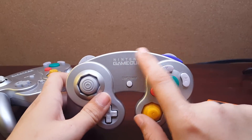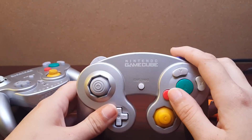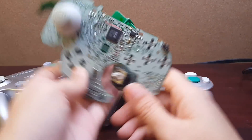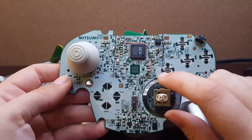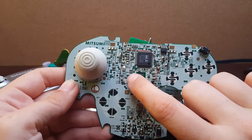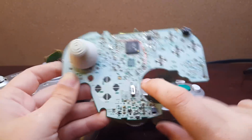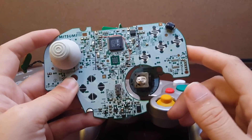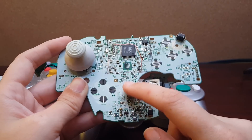The WaveBird circuit board just fits in there — you do have to trim it and relocate a few things, and I had to modify the shell in a couple of places, one down here for the batteries and a couple up in here, but it's almost an exact fit. I cut from about here up and past through the middle of the start button, over and down, then made a circle around the D-pad. So everything in the middle and down here was cut off — the channel switch was cut off, which could have been wired back, but I chose not to. It stays on channel 3 by default, though you could pick a different channel.